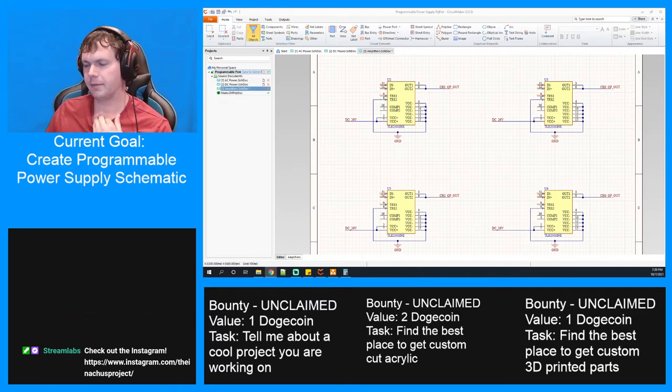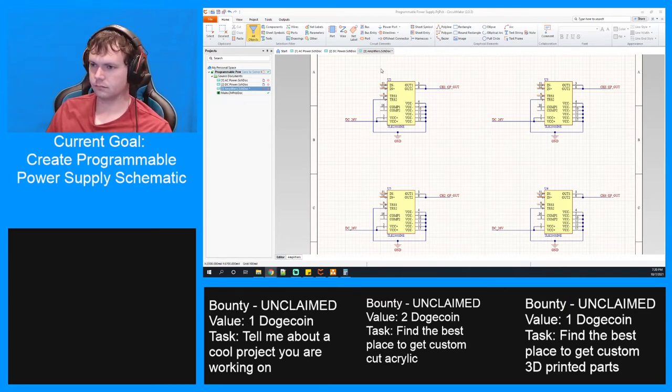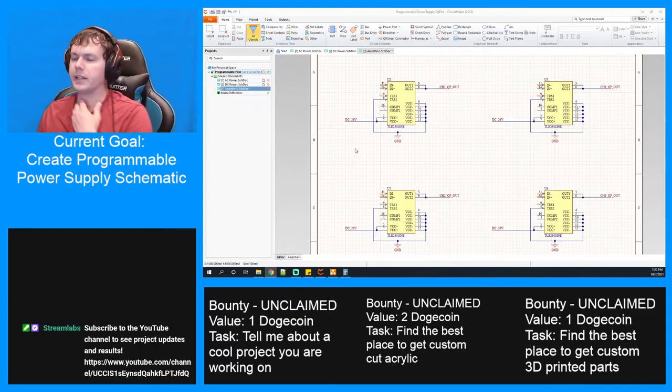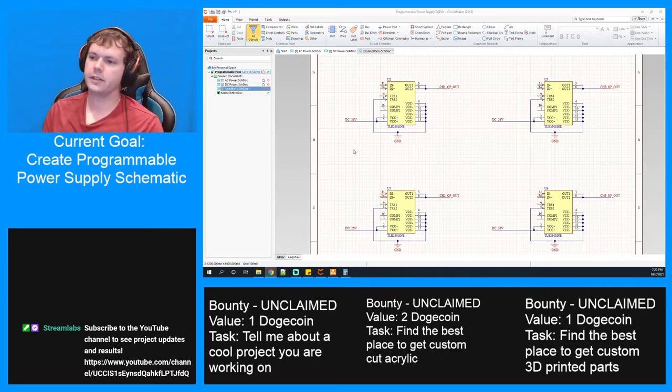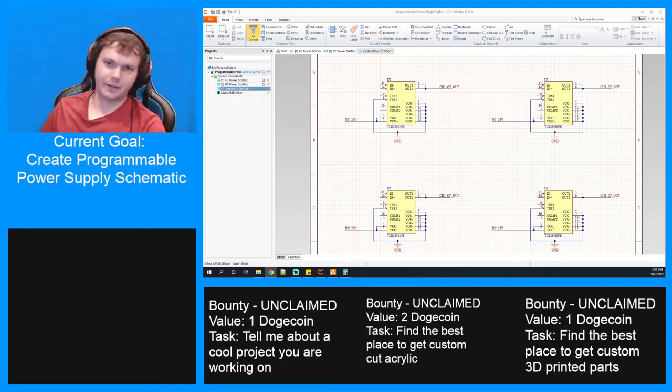So now for standard op amp, we have to do the voltage divider on the in minus. And we need a gain of 5 and probably low resistance values. Oh, turning something off if 5 volts wasn't there. Yeah, absolutely. That's pretty much what I was thinking of doing, is just having a MOSFET or a solid state relay, because I'm plugging this into the wall and it has the 28 volts coming in, right? By the time it gets to this, it's probably around 26.